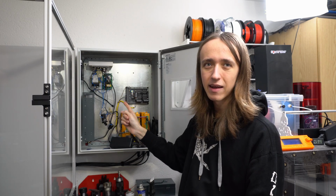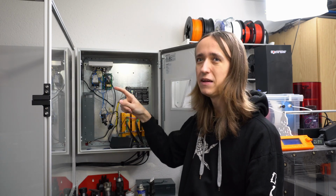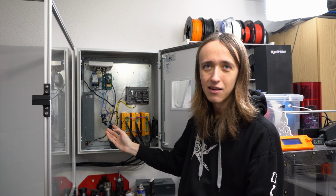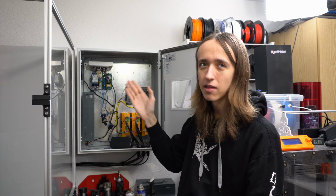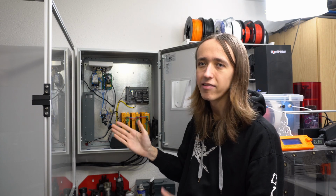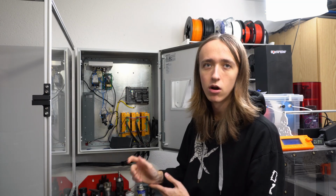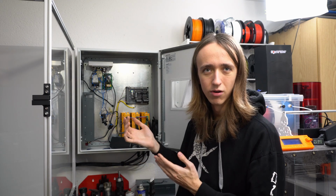But the issue now is that I also have to kind of have a feedback loop, since it is very relative, and although I can set it to a specific number, it probably is not exactly the RPM I want, and I will have to adjust it slightly. So I will need to have like an Arduino or something in between that takes the readout from the display that tells me the actual RPM, and then can adjust the signal that it sends to the controller.